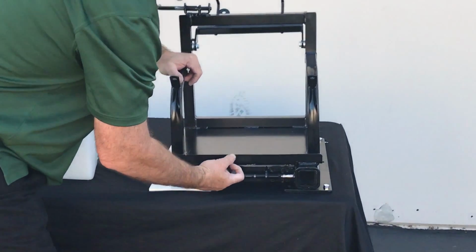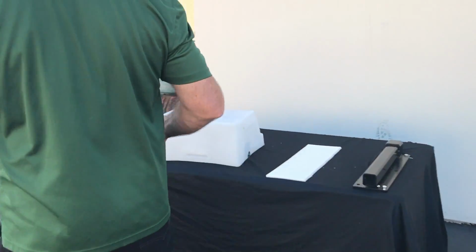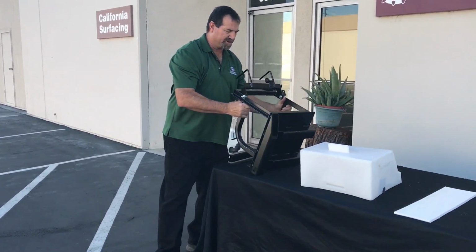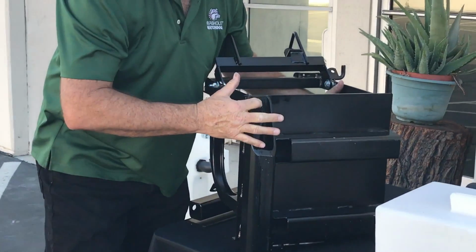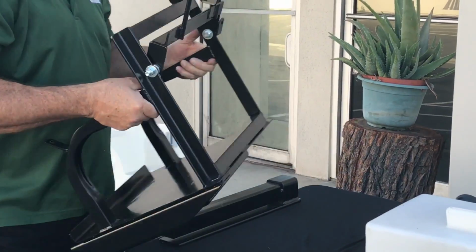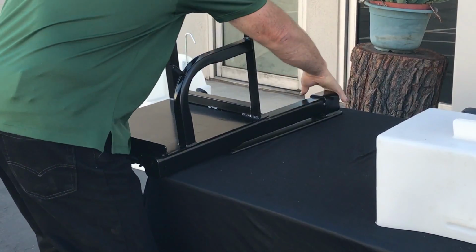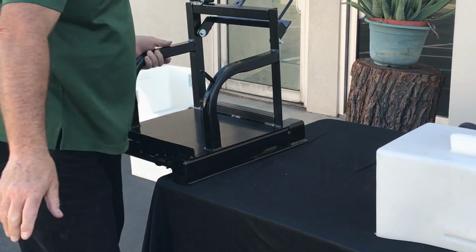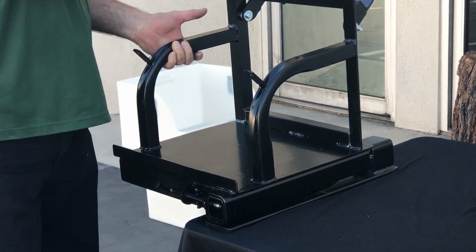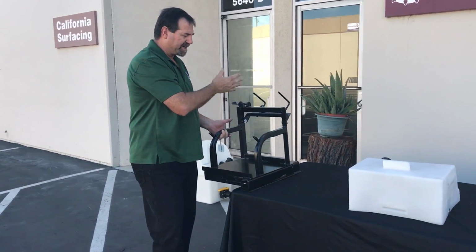So what we're gonna do is we're gonna pull this pin and we're gonna take this rack and the driver's gonna take it over, slide it into the other position. Now, what's nice is my welder came up with this. If we have this, it makes it a little bit easier, instead of trying to hit just the right hole, this gives you the opportunity to lay it on there. And when you get it adjusted and you know you have it, then you can slide it in. This is obviously going to be welded, so it'll be good. And it's built to just ride behind the bumper all the way back where your chute's back here as well, so it's not out in traffic. You would finish your washout.